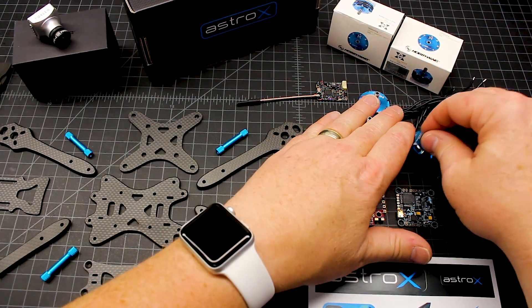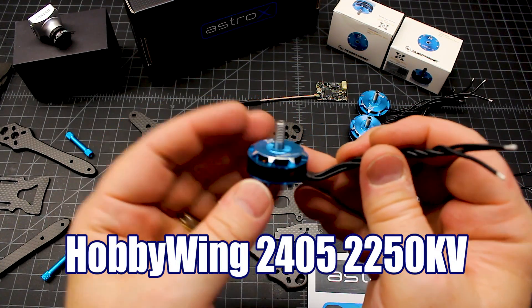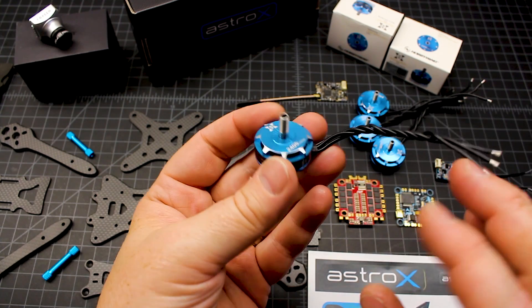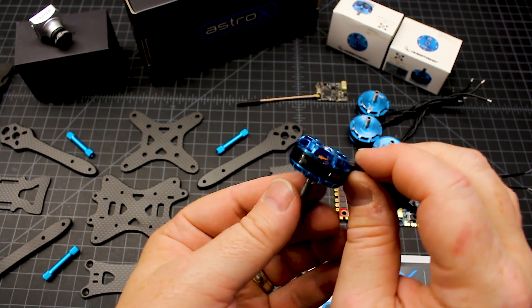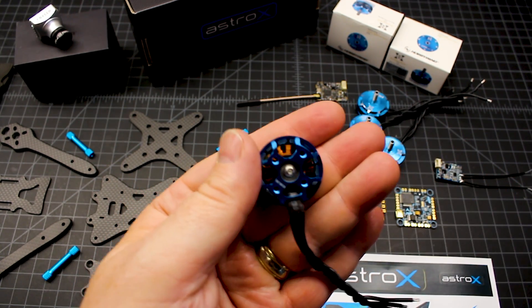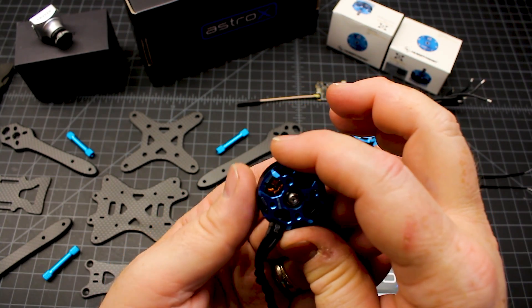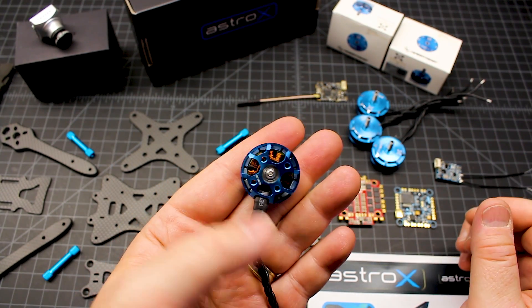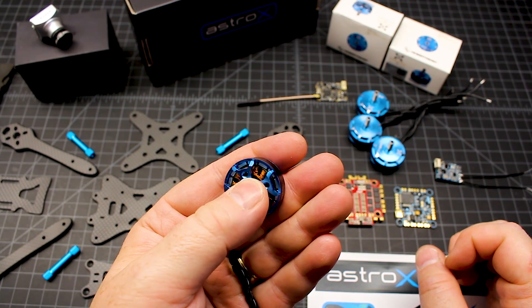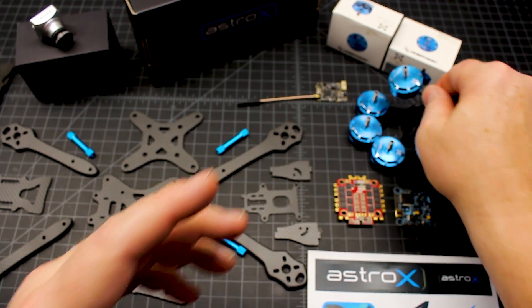So that's what we're going to run for motors. We've talked about these 2405 2250KV Hobbywing motors. Hobbywing has been in the RC industry for years making some really great RC car and truck motors, and now they're in the FPV game with the X-Rotor, which is this brand. The gap between the motor and the stator is fairly good — I've seen tighter, but this is really good. I like that they have a screw as opposed to a clip. Why don't we like clips? Because they're a one-time use — when you take it off, chances are you're going to need to replace it. So this is a really well thought-out, nice motor.